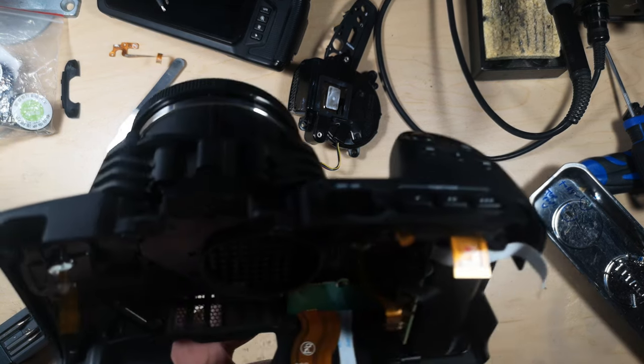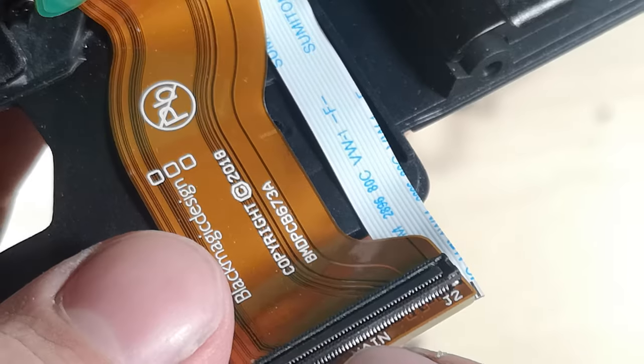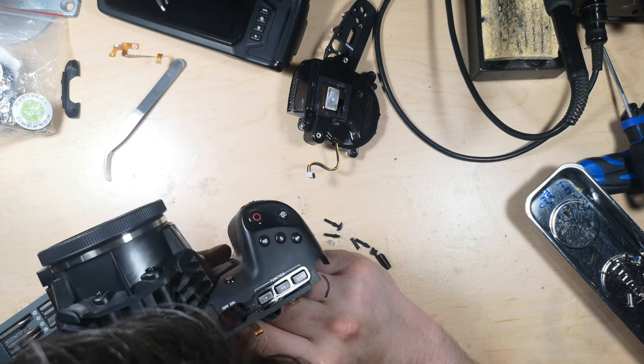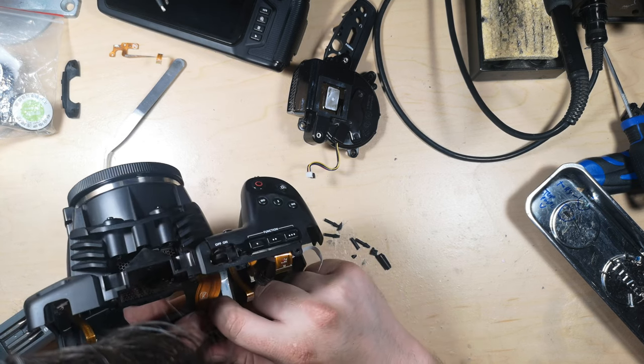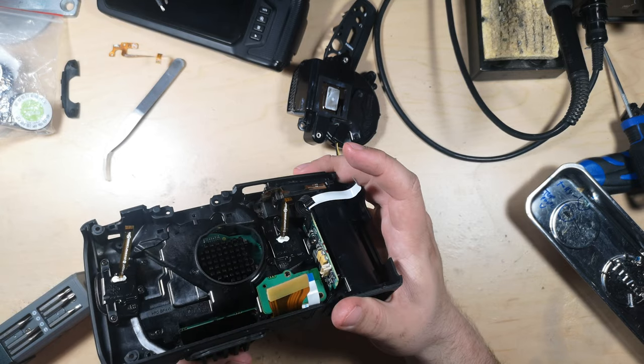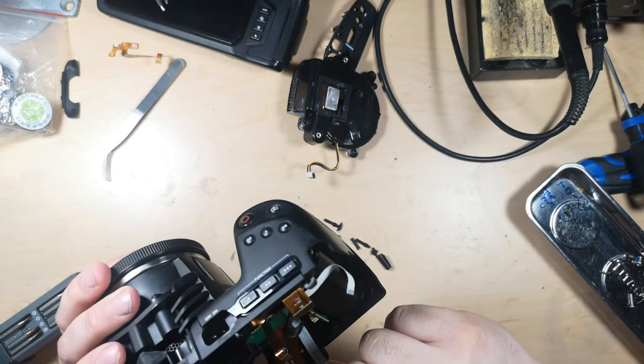Okay, so I am seeing a mark right there on the flex PCB. Okay, that is double-sided. I don't know if that is on the same trace. A little bit of a pinch there, and I'm really hoping that's just the coating looks a little messed up and nothing more. I believe this is a whole separate cable, so it would be replaceable, but yeah. That would hopefully be broken through.